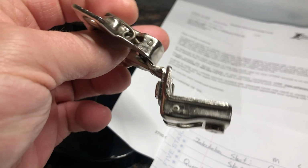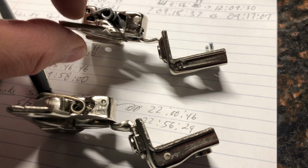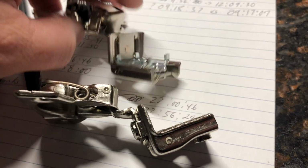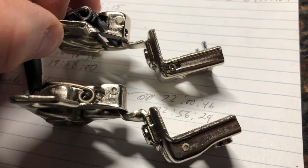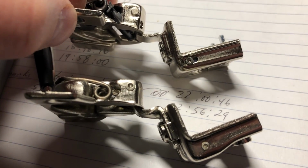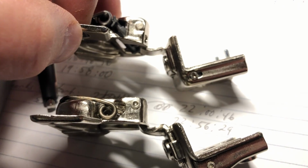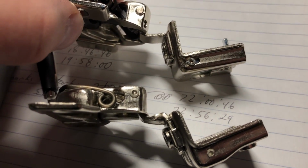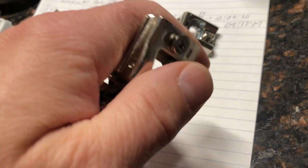So the ones that come off your cabinet, and you're going to want to try to find ones online that are just like it. So the challenge is going to be, the pictures really don't do it completely justice, because you can find hinges that look awfully similar, but they won't fit. They will either be too small or too big, or shift the door in the wrong direction. So what we're talking about is overlay. And what you're going to need to pay attention to is that overlay number in the description.